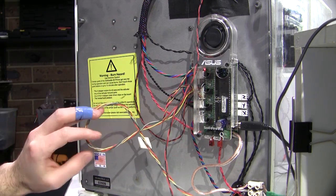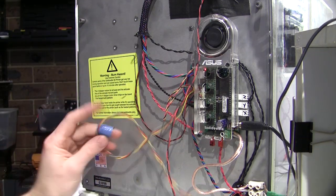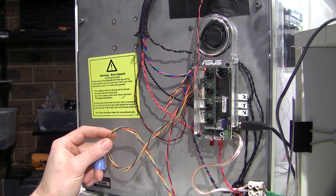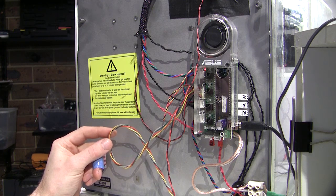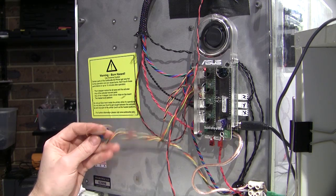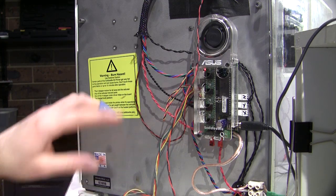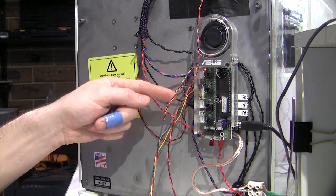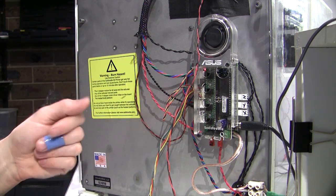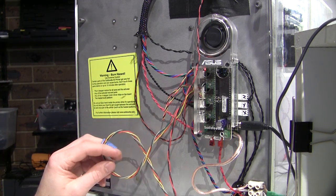This is actually for the other stepper motor that I bought for the Acme lead screw, which I found not only with the stepper motor, the plug was in the wrong order. So if you plug it in and nothing happens, more often than not, I would say, your steppers are in the wrong order, or each coil is in the wrong pin location. And then also if it turns the wrong direction, that means you need to reverse the plug basically. So you can just play around with it. You shouldn't hurt anything. It'll either not work or go the wrong direction.